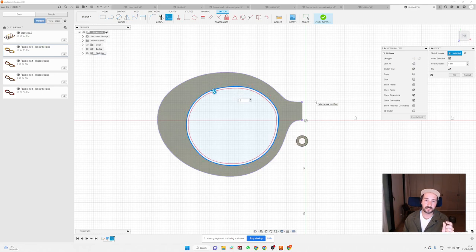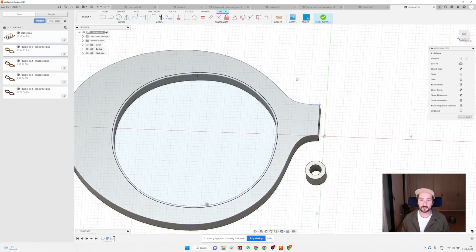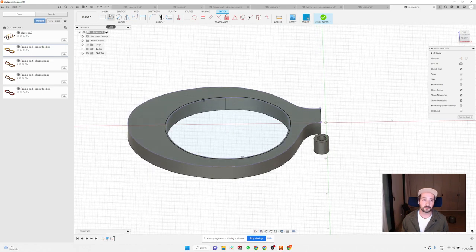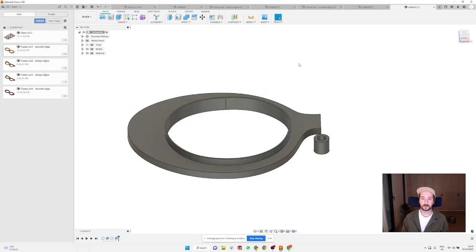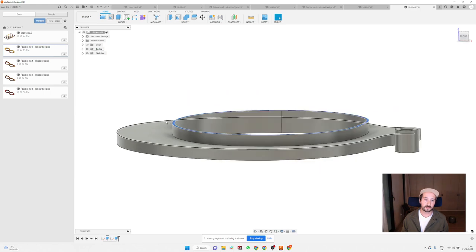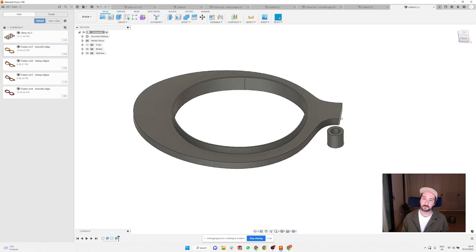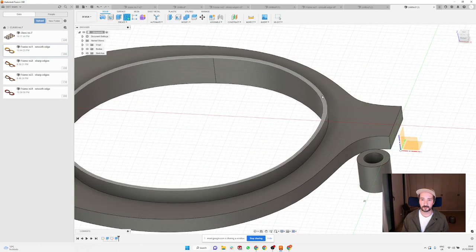You can try different dimensions. I'm gonna try here, let's say -0.5 millimeter, and then there's a little trick I figured out that looks really good. Because now you can go extrude and move this whole body, let's say -3 millimeter lower, and then we're gonna make a transition between this top line and this edge. But when I did it last time, I ended up with, I'm actually gonna show you. I'm gonna create a sketch here on the top.